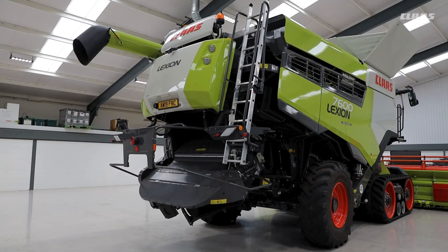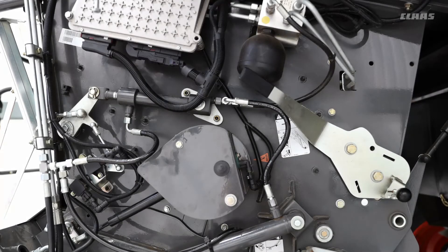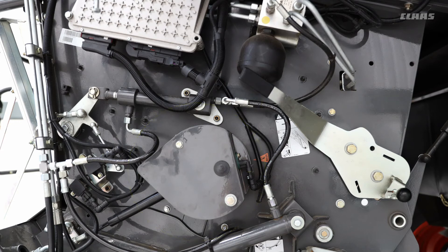On the right-hand side at the rear of the machine, take the cover off and underneath the cover there are some grease nipples for the gearboxes. Also check the gearbox oil levels, but make sure that the radial spreader is in the correct position before you check the oil levels. On the right-hand side of the chopper at the rear, you also have the bearing — please make sure you grease that correctly at the right time. Also check that there are no leaks from the pipe work at the rear end, and keep the area clear as required.